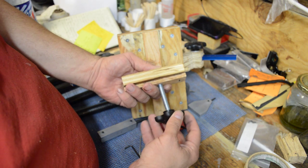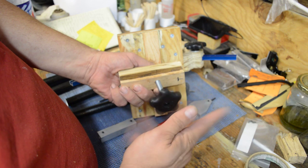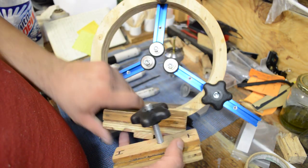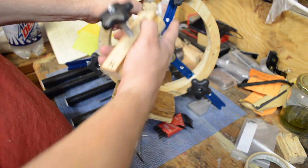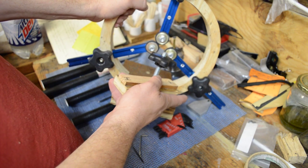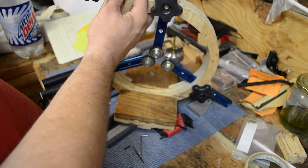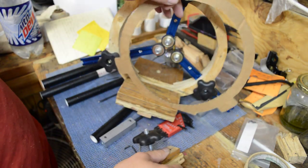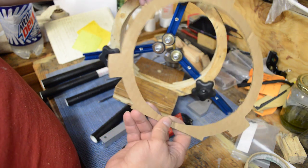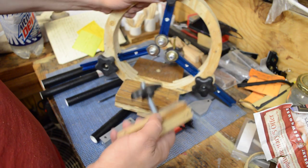That way when you're done you can unscrew your nut back up toward the threads you're cutting smooth, and use your nut to clean up the threads. Then your knob goes on through the hole and clamps on top. Pretty good little steady rest. I think the bar was $14 and the knobs were $1.50 at Woodcraft — I've got less than $30 tied up in this. I made a cardboard template to mark and cut everything out. I always use a cardboard template so I can fold it up and keep it if I need it again.